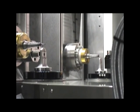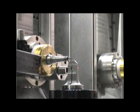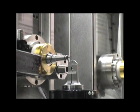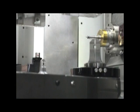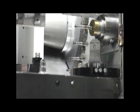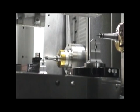Each module has an automated 16-position pocket wheel type tool changer with HSK spindle adaption. Each 4-axis mill turn module has a standard configuration with an option of 10, 20, 40, or even 60,000 RPM — now that's high speed machining. There's an integrated servo motor for that 4th axis for fixture positioning, interpolation, or turning capabilities up to 5,000 RPM.